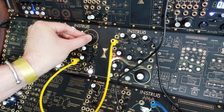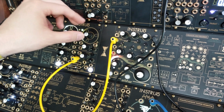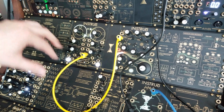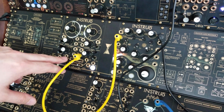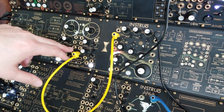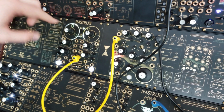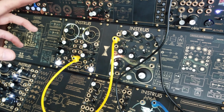And we're sampling at a very high rate, it'll be 96 kilohertz for the final build, so it gives a lot of resolution when you're stretching out the audio to keep it really clean. CV controls on the module itself. There is CV over the crossfaders for the auxiliaries. You have a retrig input, which you can use in addition to this button to re-trigger jumping back to the start of the playback position.